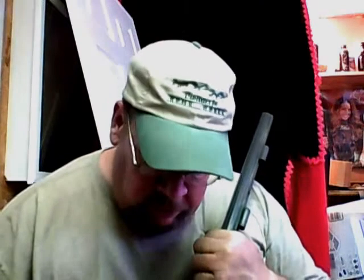Alright, got that on there. And you know, when you put your bluing on it, you take a little bit of steel wool and you rub over it to get that old haze off of it. And then you go back through process 1, 2, and 3 again. So I'm going to get a little bit of this glaze off of it before it cools down too much, so it won't be so hard for me to warm back up the second time.